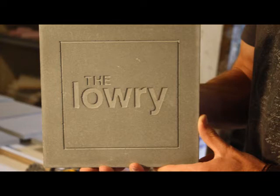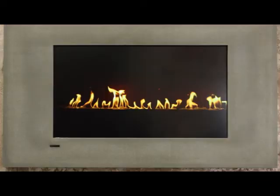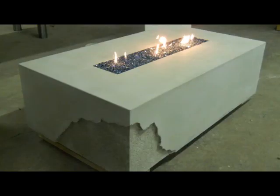This is actually a television frame, and this is only 1/2 inch thick concrete, made to look like 2 inches solid, which now is turned into that mirror back there. And if you flip it forward, you see it looks 2 inches solid, but it is really only 1/2 inch thick. Some different dimensional things you can do with the concrete, with the glass fibers, that you can't do with traditional concrete, is this piece is only 1 inch thick, but looks like one solid piece.